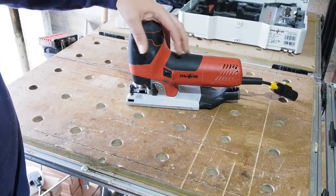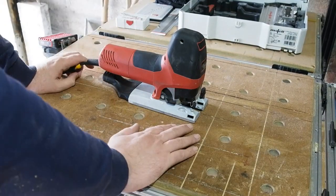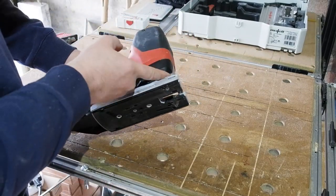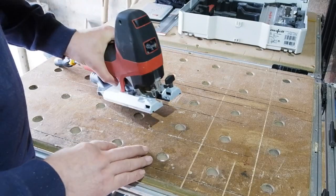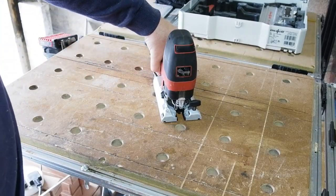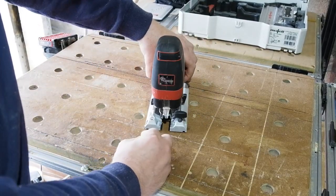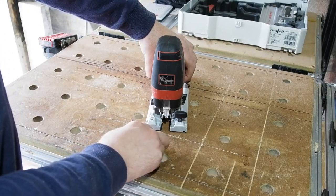The squareness of cut using the Kunix blade has meant I've been able to cut decorative rafter tails with confidence and any number of scribes — I always know the blade is going where I want it to. With standard blades you'll get near enough the same wander and deflection you would with any other high-end jigsaw, but even then the way the Mafell puts the power down is quite unlike any other jigsaw I've used. It can just pound through material but at the same time is smooth and controllable enough for very fine scroll-type cuts. It feels good in the hand, nice and comfortable, using it right way up or upside down.